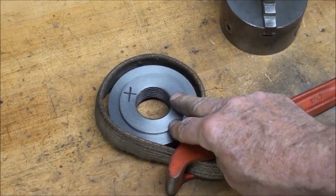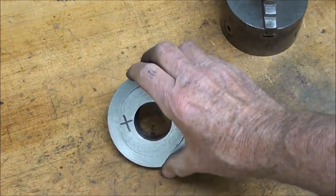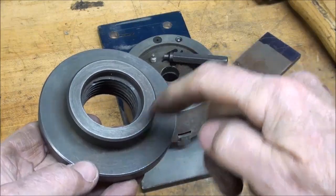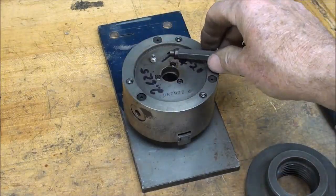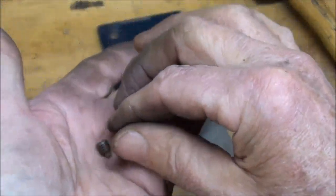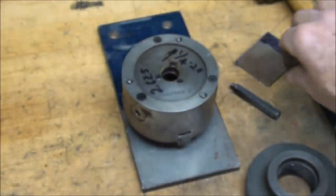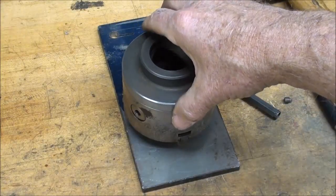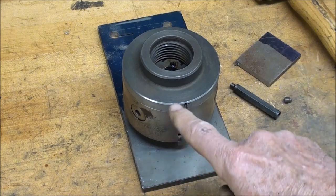In order to unscrew this piece from the lathe spindle I had to use a strap wrench — there just wasn't any other good way to hang on to it because I didn't have enough grip in my own hand, and I certainly didn't want to put any tool marks on there. Next I need three holes equally spaced here for the cap screws that will hold the backing plate onto the chuck. There are three threaded holes here — one, two, three — and they are quarter-twenty. I have already installed in those three holes transfer screws — Hyman transfer screws. One of my other videos talks in detail about these, but they come in every size. Get several sets; you will love them. It's the most practical way to transfer blind threaded holes. Now I will put the plate on there and temporarily mark it with some index marks so it will go back on always the same.